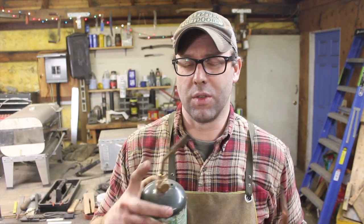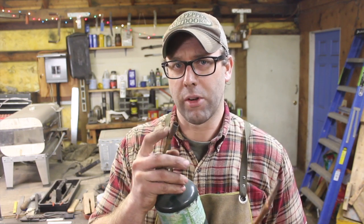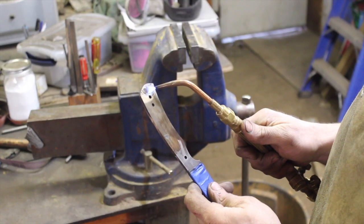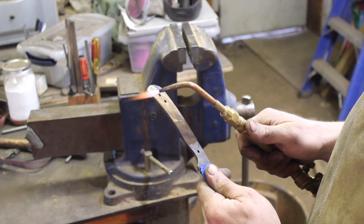Fortunately we don't have to heat up the portions we want to drill extremely high, as we would with traditional annealing. My favorite way to do this is to use my propane oxygen torch, but you can also use a small torch that just uses the venturi style burner on it. And depending on where you're trying to soften the tang, if you're very careful you could probably even get away with doing some of this in a forge, periodically cooling the blade — but I haven't tried that. I prefer to use a pretty small flame on the torch, though a larger flame works too.